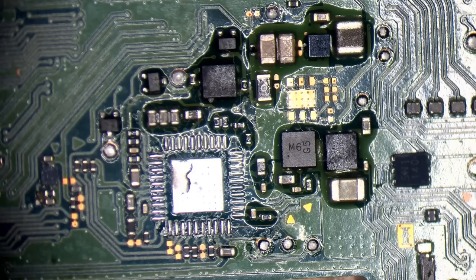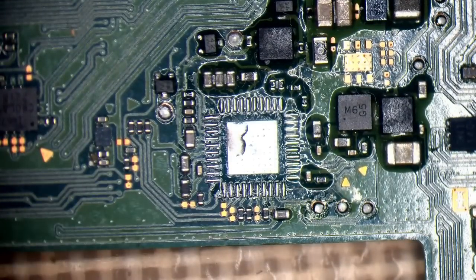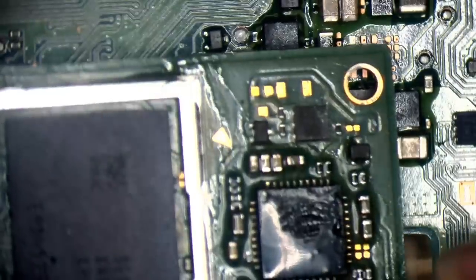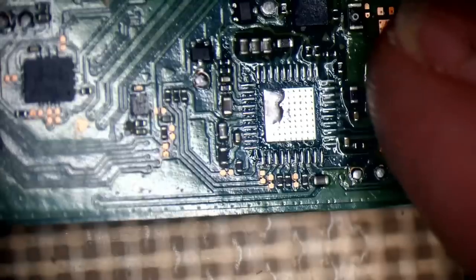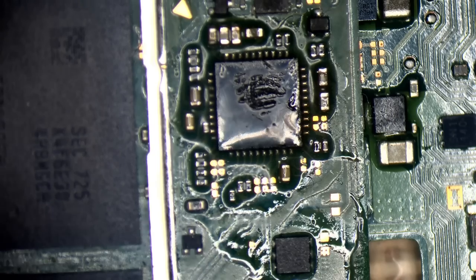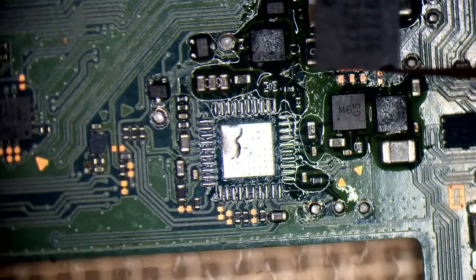I've got this board in an L-shaped orientation. Pin number one is the top left-hand corner on both boards, so that's how I always hold them. First I'll pull this M92 chip off. Hot air is set at 420°C at 40% airflow — I tend to go a bit lower on temperature for Switch boards because they're pretty thin. That chip came off pretty quickly. I'll drop this chip in position, but I need to tin the pads first so surface tension works in my favor.